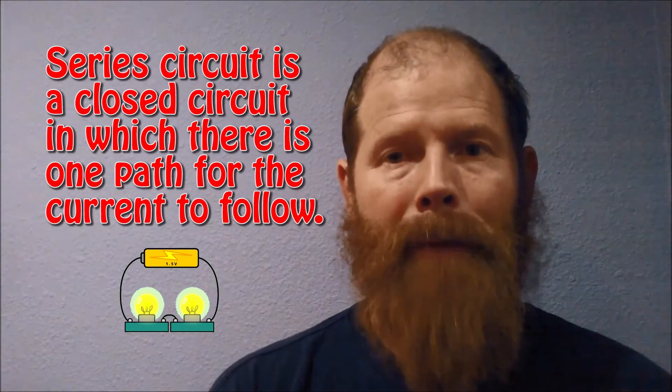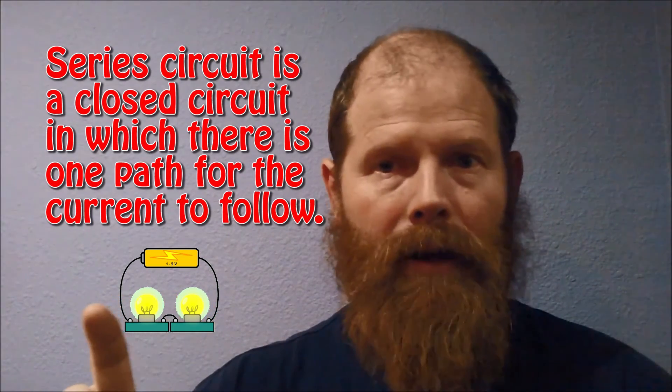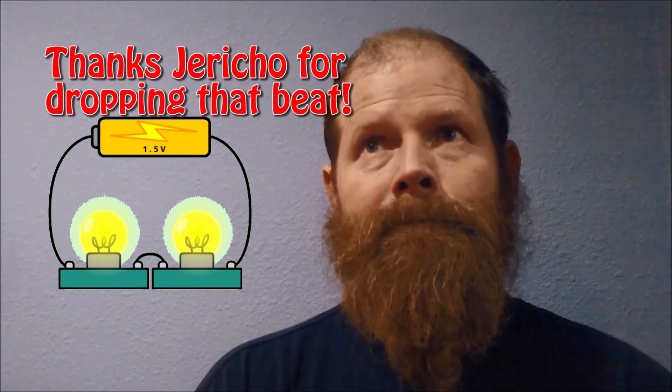You also put more than one light bulb in the circuit. You may have developed a circuit with a battery and two light bulbs, and found the light bulbs were fairly dimly lit — maybe barely glowing. You learned during the lab that this is called a series circuit. A series circuit is one where there's only one path for the electrons to follow. If you put your finger on the positive side of the battery and move along, if you never have to make a choice — only one way to go before you get back to the battery — that's a series circuit.